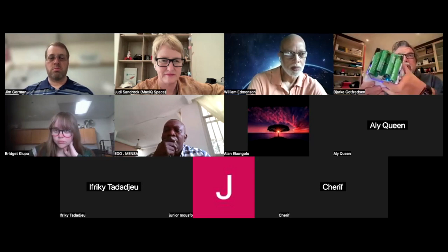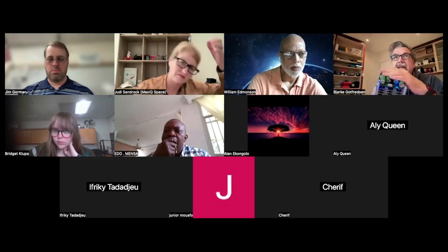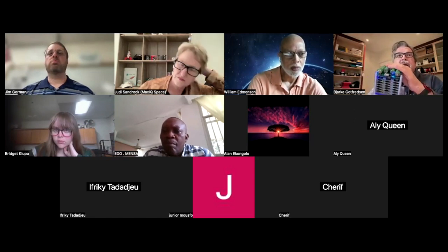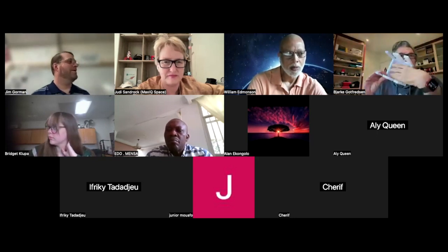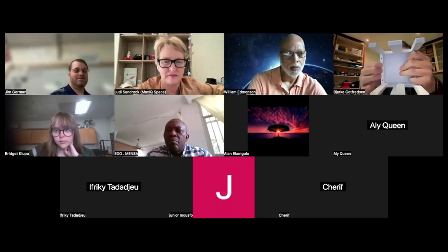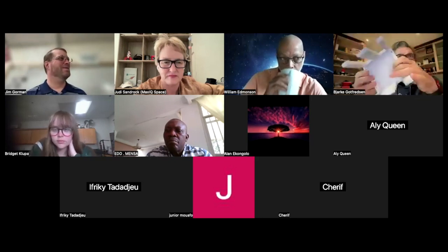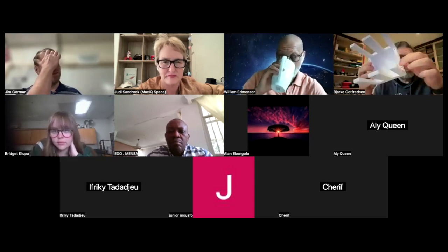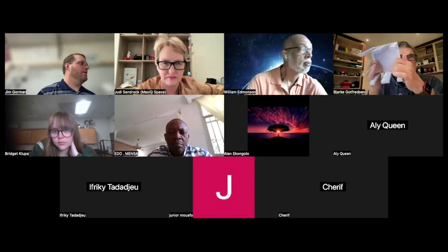Now, I've been working with 4 batteries so far, but the next version is actually only 3 batteries, because I calculated that 3 batteries are fine, and I needed that more space. One of the other things is that the reason this is this high is because the battery goes up into this space here. It's quite a thick wall, PLA, like polystyrene, and this is 10% infill. So it kind of locks the air inside, so they all work as insulation.